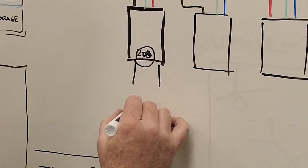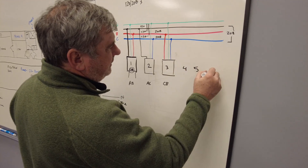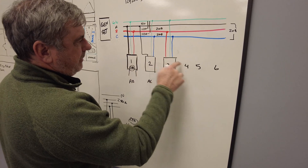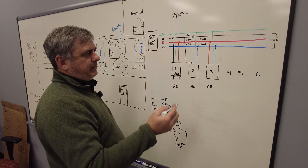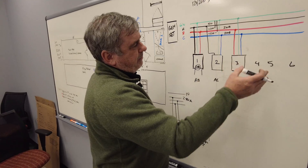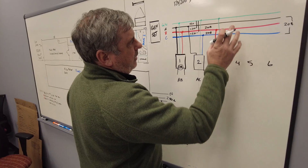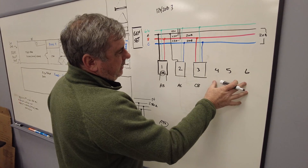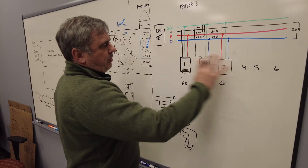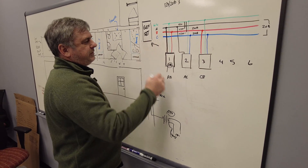So this would be AB, this would be AC, and this would be CB. If you went to panels four, five, and six, you'd just repeat these same patterns. A lot of times we may have 21 panels — we always try to have a number divisible by three so it balances the load. Once you get a few out there and the load distributes, we're able to fully utilize our cabling and this architecture, giving us a balanced three-phase load back into our generator set.